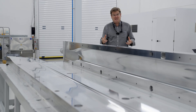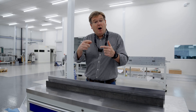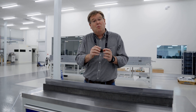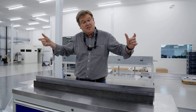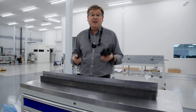The big composite tools that you can see behind me actually just make the carbon fiber part of the blade — so the spar, the trailing edge, and the leading edge, less the erosion shield. We make the erosion shield separately, and that's done with a range of metal forming processes. For the longer, straighter portions of the blade that just have limited twist and some variation in aerofoil section, we can use fairly traditional methods.